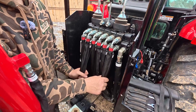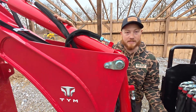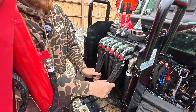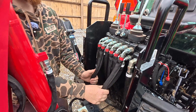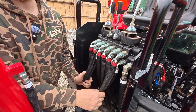I'm more of a guesser — and if it's wrong you just swap them again. What we're trying to do is swap this cylinder with this cylinder essentially. We traced these hoses and know that this one is running one of those cylinders and this is running the other. So we're just going to swap the bottom two and the top two, then test and verify that we've got it right.